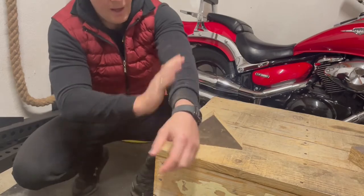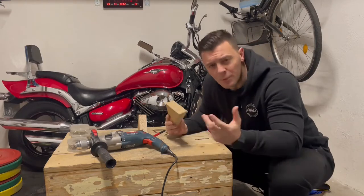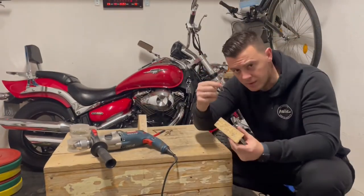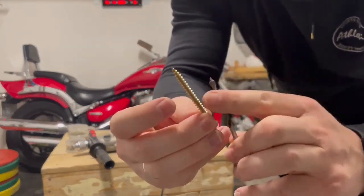This is another one — I'm a little bit dusty but it was worth it. One more thing that we will do to make this whole process easier is drill a small hole right here with the drill bit, and this drill bit should be just a little bit smaller than the screw that we are going to use to connect the corner wood piece to the table sides.